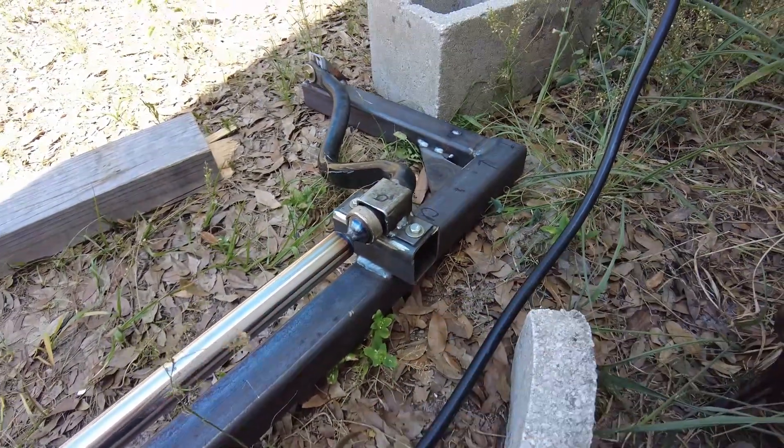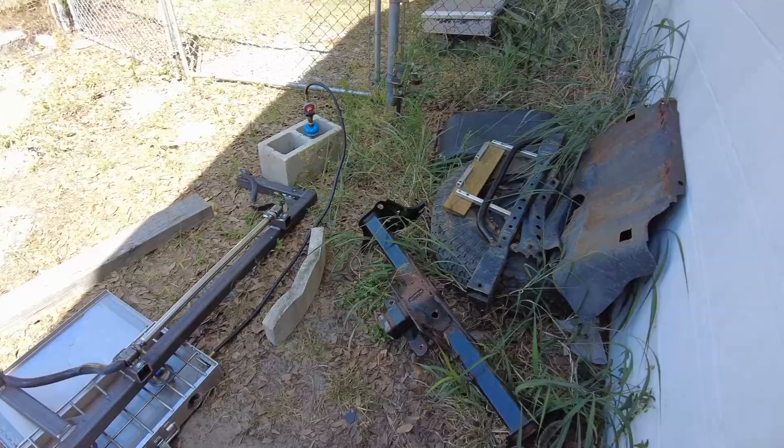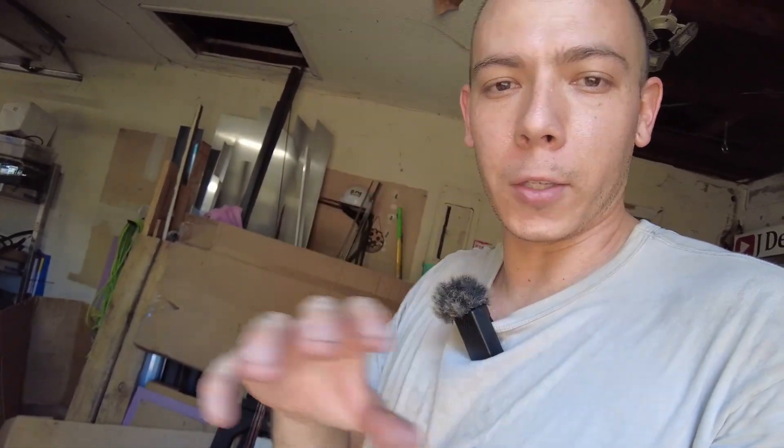Holy shit, that's hot — 360. I think this side is closer to 400. That's a lot, but that's what we want: we want the bottom jig to be super hot. I temp-gunned the top part right after welding and it only showed around 250 — obviously when you're actually welding and the metal is molten it's a whole lot hotter; it's just the material dissipating heat throughout the rest of the structure. We want to try to get the entire part up close to welding temperature to minimize warping.